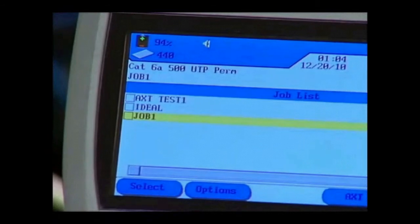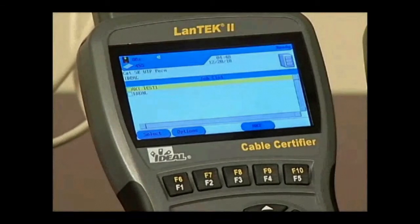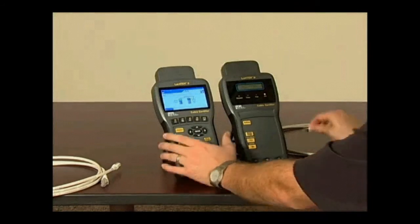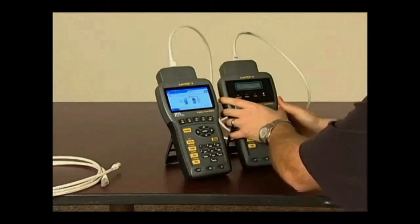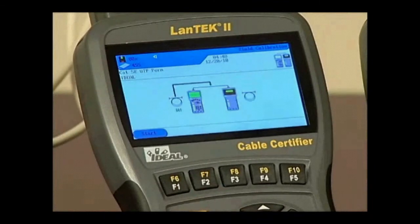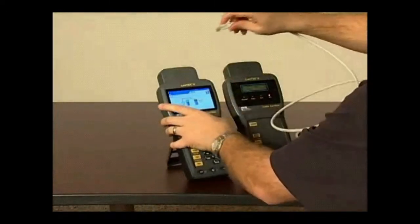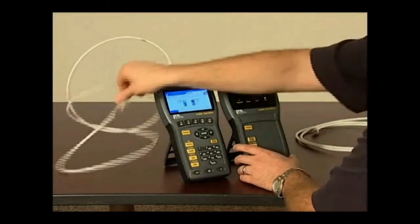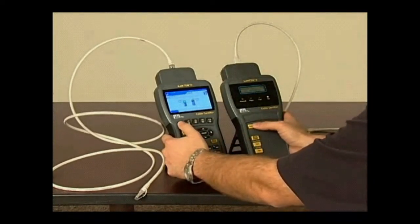Return to the Ready screen and highlight the field calibration icon, then press Enter or F4. Connect the remote handset patch cord between the two units. You can use the provided cords or the brand of patch cords that match the installation. Press F1 on the display handset to start the calibration process. Next, disconnect the remote handset patch cord and connect the display handset patch cord, then press F1 again to calibrate. Disconnect the display handset patch cord from the remote handset and reconnect the remote handset patch cord to the remote handset. Now press F1 on the display handset and press Auto Test on the remote handset. This screen will appear when both reference patch cords test good. Press Escape and the units are now ready to run tests.